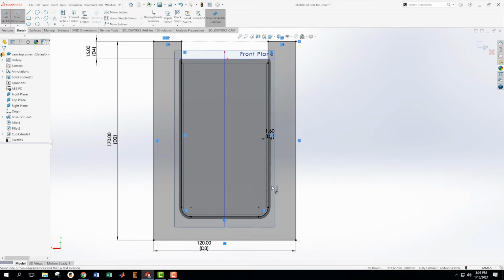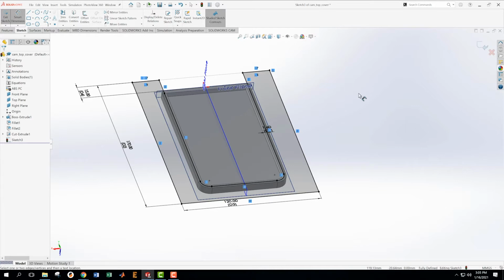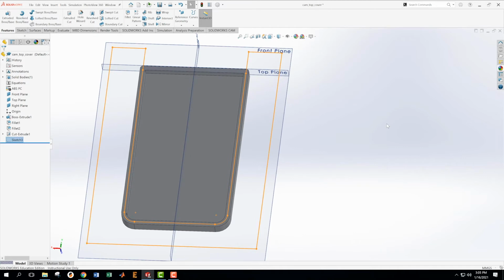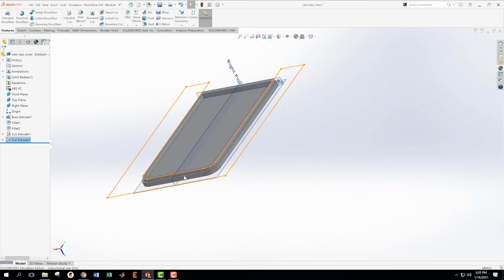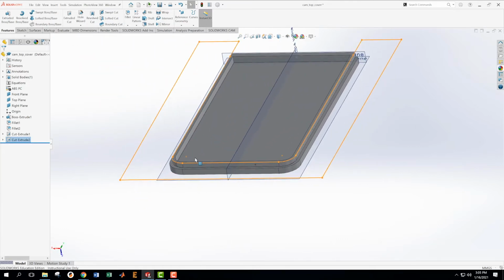And I'm going to use this shape, this U-shaped thing, to cut downward into my part. Okay, yeah, see this U? It's going to cut downward some depth. So I'm going to use this for an extrude cut. And the question is, how far do I want to go? I'm going to have to look at the drawing to know that. We're talking about detail Q. So I'm going to go down 2.8 on this, according to the drawing. Okay, 2.8. Okay, if I accept that, now we see we are getting something that is starting to look like a piece of plastic.